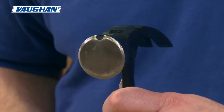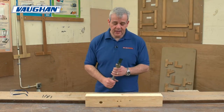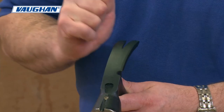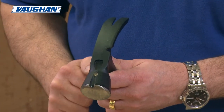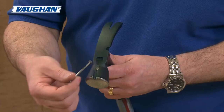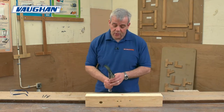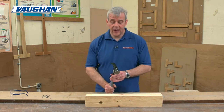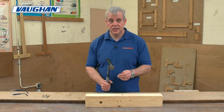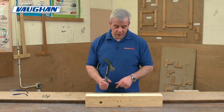With this one, you've got an oversized, larger than normal striking head. This is a lovely 20oz hammer, so you've got a much bigger target for hitting. And then at the top here, you can see you've got a grooved recess and a little recess with a button — that's actually a magnet, and that is a nail starter. I'm going to show you how that works. Simply take a nail and it's held fully in place there — it's not going to go anywhere. Take it upside down, it's not going to fall out. What you use that for is if you're working at length or overhead, sometimes it's difficult to reach and grab the nail to start it off, or if you're in difficult-to-access areas, or if you're just not confident you might hit your fingers.